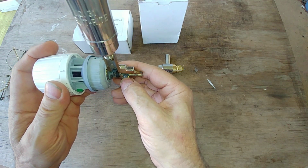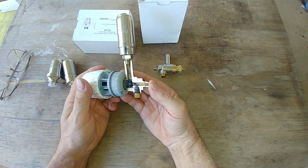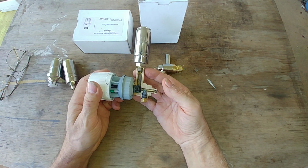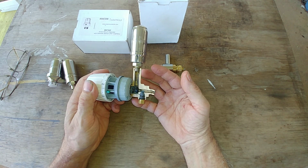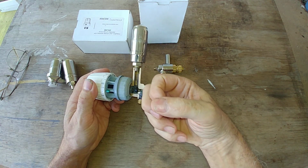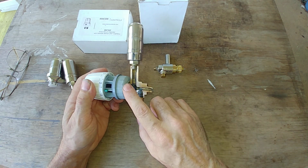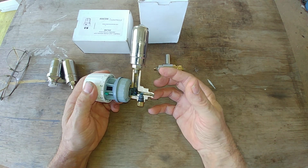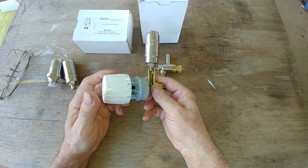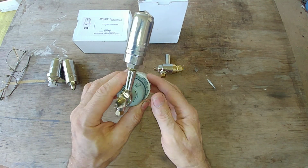This thing does break, so you've got to watch this. And the other thing that can happen is that the system could be run at too high of a pressure, or more subtly, it never shuts off. A steam system has got to shut off. The system has got to be able to draw air into the radiator, trapping more air in the radiator so this device can function. If the boiler never shuts off and is constantly supplying steam pressure, this thing will be overridden, and you will be disappointed in its performance.